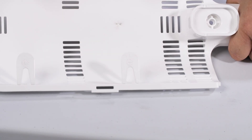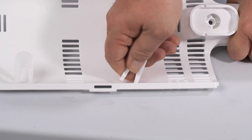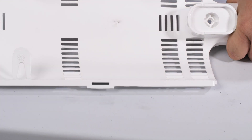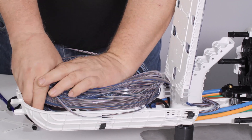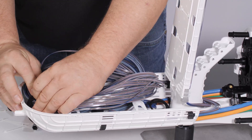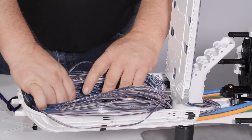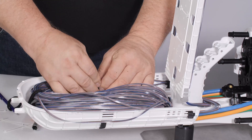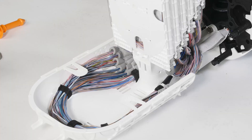Basket tabs can be removed for easier access to the basket and replaced later — simply squeeze the sides and rotate out. Note orientation for later replacement. Coiling for flat ribbon is shown in this video, but the process is the same with spiderweb ribbon, ribbon, and loose tube. Input fibers should be secured near the yoke with velcro or tie wrap. The standard length in the table is defined as one pass of the basket, then exit to transition to splice tray.